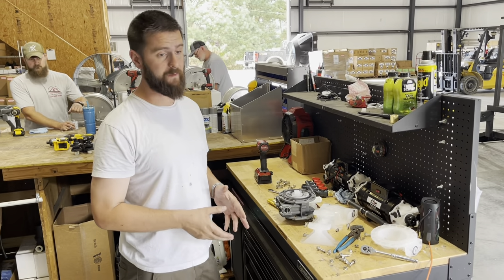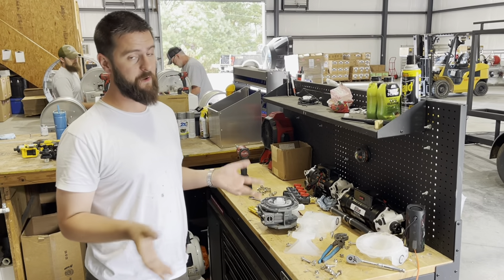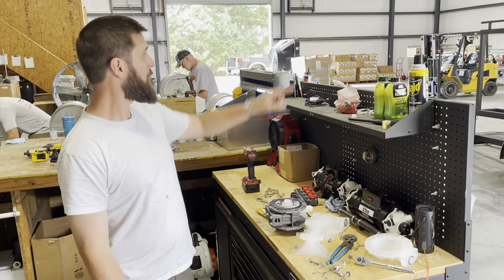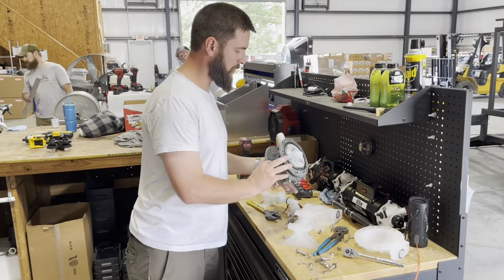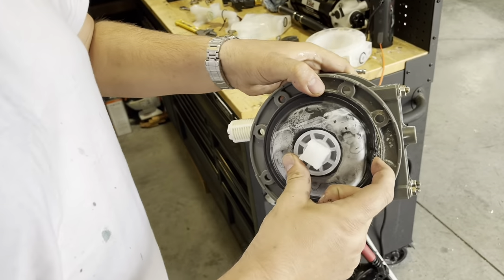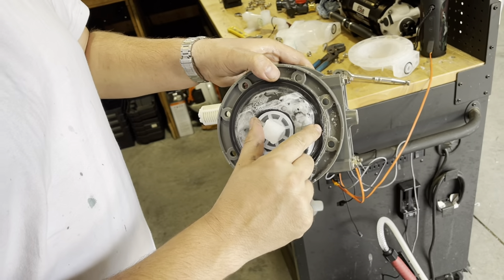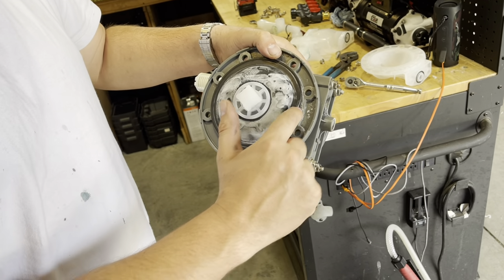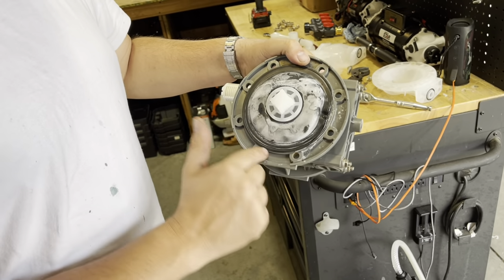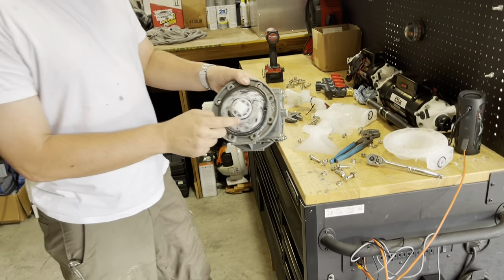So this is an old pump that we had — I think it's the second one. We've run thousands of gallons through that tank. The pumps themselves are very robust; we're just hitting it with too much air. You can see our compressor over there on the wall — it's just set too high. What's happening is it's blowing the O-ring. As you can see on this one, that's the same thing going on outside on the other one. It's found a weak spot — right between two of the bolt holes, which is probably the weakest point. Any of these all the way around, it bloated out.